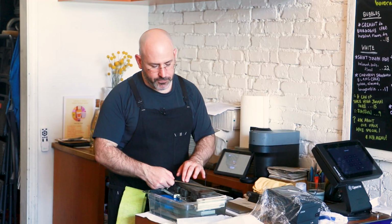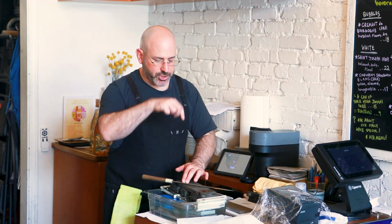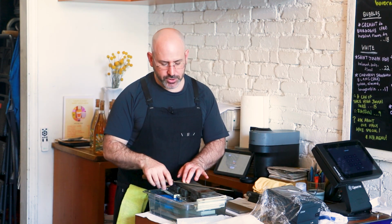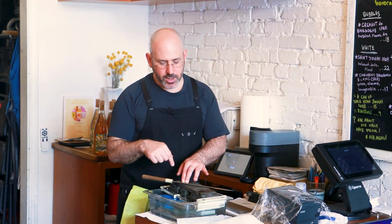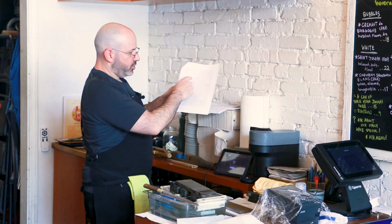So when we are sharpening the first section of the knife, our fingers are going to be on the opposite side of that shinogi line, and my pressure is going to be down against the stone and up towards the shinogi line. Not so much that it's rocking over, but if I'm trying to push it up a little bit. When I do the second part of the sharpening, my fingers are going to move down towards the edge. My fingers are going to be as close to the edge as possible without touching the stone, and I'm going to sharpen there.